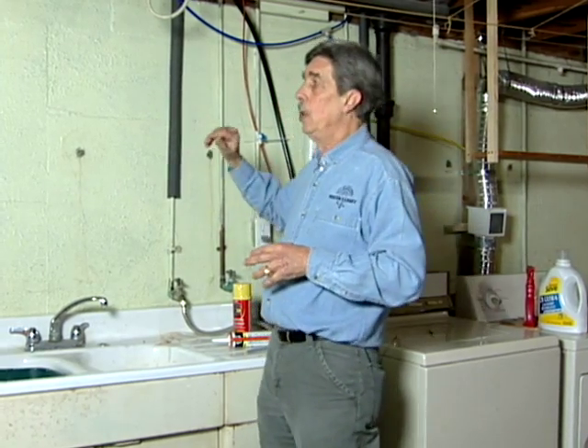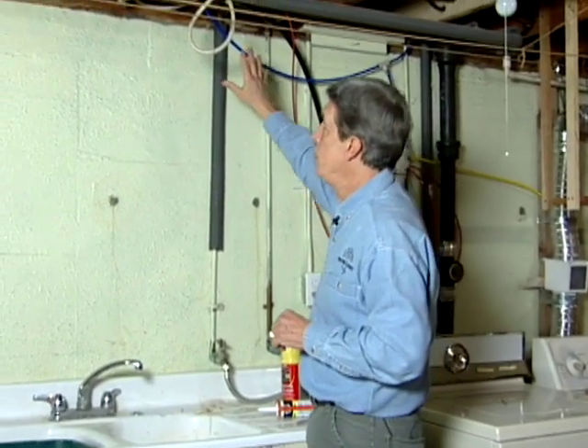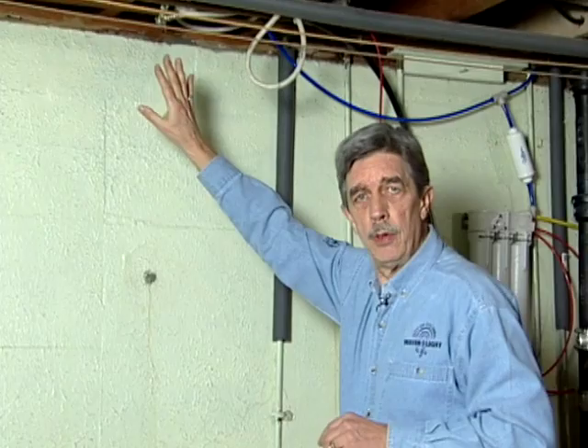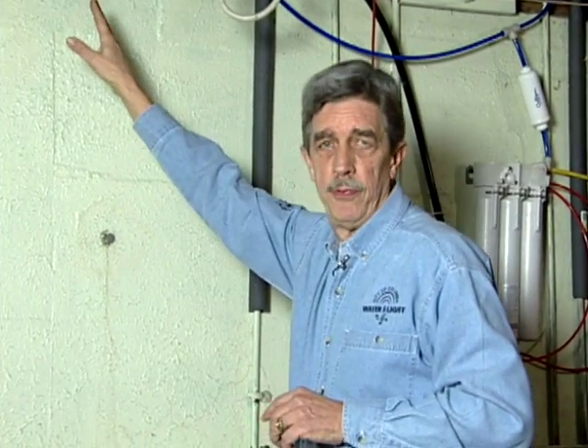Going online from the main pipe coming in, we're going to find out what's going on with the rest of your plumbing. If you have kitchens and bathrooms on the outside wall, there's probably some plumbing in that area. So you want to police the area, see where your pipes are coming in, check various appliances, and see if you have any penetrations where air might come in. You can see daylight, perhaps, that might be coming in and causing a pipe to freeze.